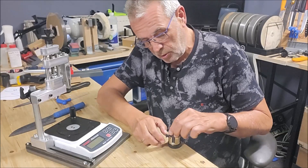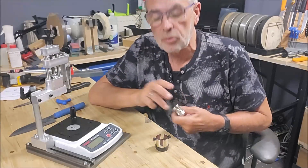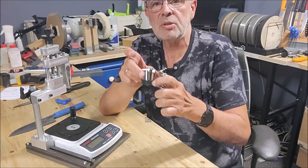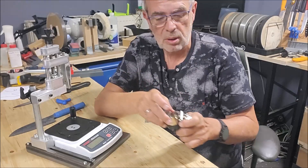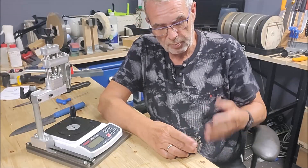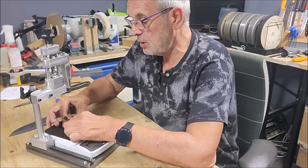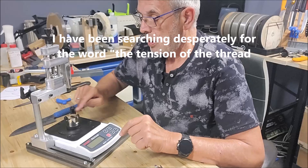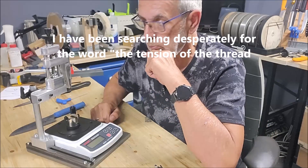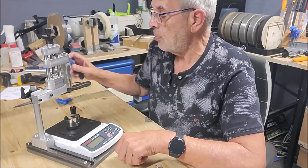So what I will do is I like to make the results compatible with each other. For this I had two things to do. First of all, what I always do: I take a 100-gram weight, clamp it, and let it hang over the table. So I put 100 grams on the string, and now I always have the same pressure. After I prepare this, I put my knife in the clamp.